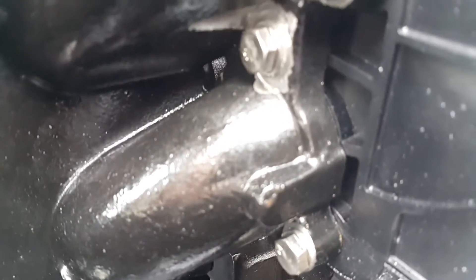Going around the front — the fuel distribution hose looks okay, no fraying. The large mold looks okay, a little dirty inside but you can clean it out. The blue wire is the SmartCraft wiring — you may not have this in your motor — it goes to the SmartCraft gauge up front and is very useful. I highly recommend you buy one if you don't have it. Everything looks good on this side.